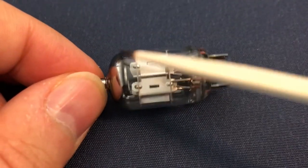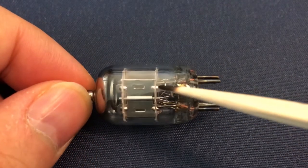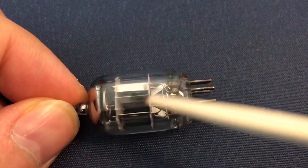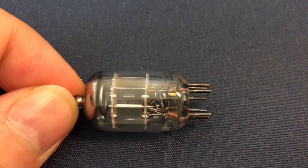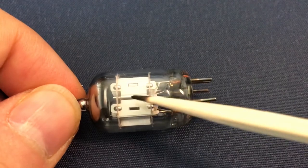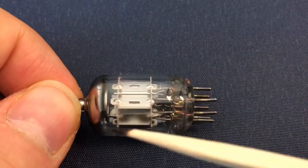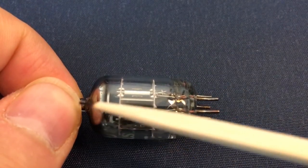During production, they suck out air from this port and at the same time they heat the entire structure, both with a general heater and an induction heater, so that all gases absorbed into the metallic parts and other components are released and sucked away from this port.